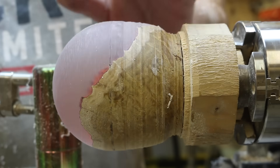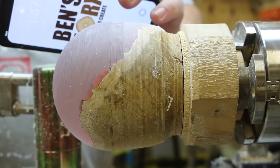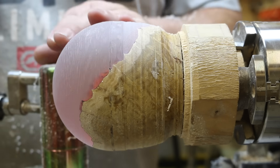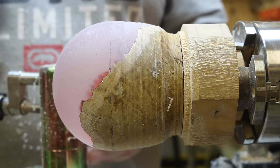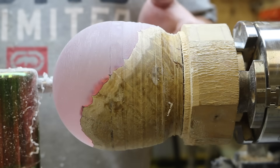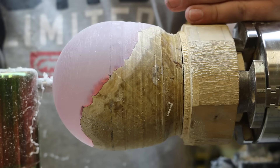I've finished one half of the sphere. We started at quarter past one and it is now 1:47, so it was about half an hour. You can make this go a bit quicker if you do the front and back side in the same pass, but because I'm showing you how to use this jig I thought I'd get the front half out of the way first. The back half is a little bit more tricky because you need to keep it on the waste block for as long as possible.